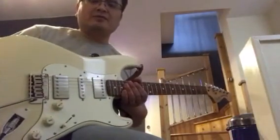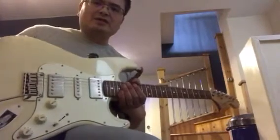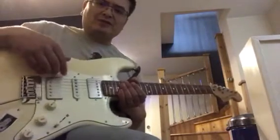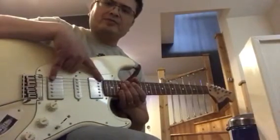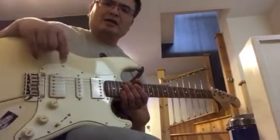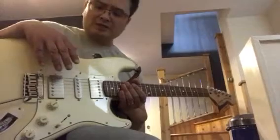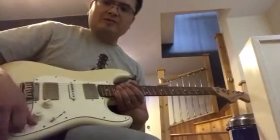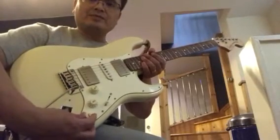So basically it's the most practical and versatile switching that I could think of to fit in a Strat that's not routed for push-pulls, for me to get both my bridge and neck on together, and also have the same quacky positions that you're used to getting on a Strat, while still being able to coil split. So there's my three-way selector for the coil splitting, just there.